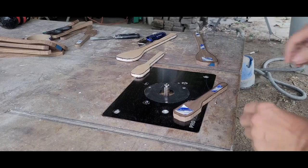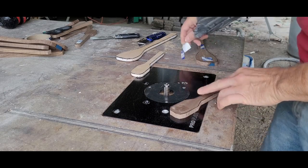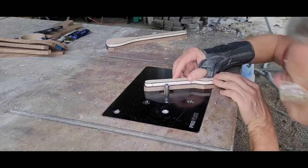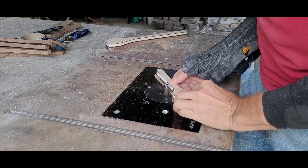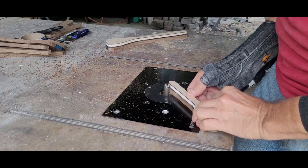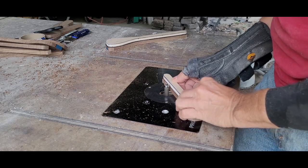Now you could go straight from the bandsaw to the sander and skip the upcoming drama, but I do love my routers. So I set up my router table with a half-inch diameter flush trim bit and set the bearing height so it would ride against the template. This gets a bit sketchy, and I did have a couple of catches while cleaning up the blanks. And I've never gotten used to using hold-down paddles at the router table, so I'm very conscious of where my fingers are at all times.